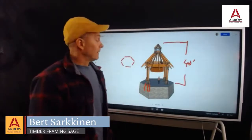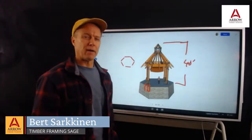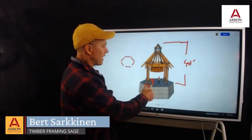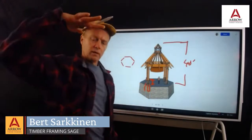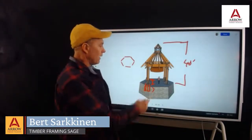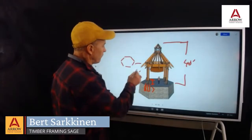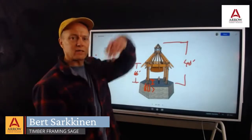I had a few nights, I don't know how many, where in the back of my head I was worried about this whole process as we're going up. You've got 36 inches high or so of this big bracket, and they don't look like much here, but they were gargantuan things. They stood about 6 foot tall because you have these big wings, fins, that went down into the concrete, but only roughly 3 foot poking up. And then it's 16 feet to the beam, 16 foot of post. So you're looking at a ratio of 3 foot, and then 16 foot above that.